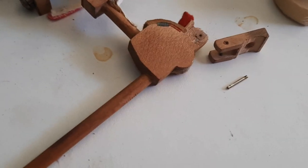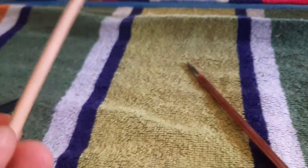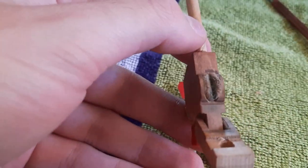But yeah, protruding from the stamper board are these wires. And the purpose of these wires is to help push the hammers back when they come forward. And, you know, these wires, they bend back, but that's all right. But at least one of them over here is broken short. And the wires are supposed to rest inside here to prevent the hammers falling from left or right while it's pushing on them.